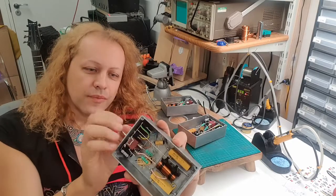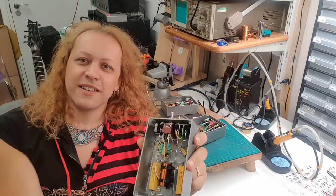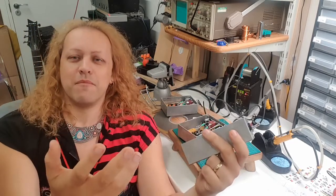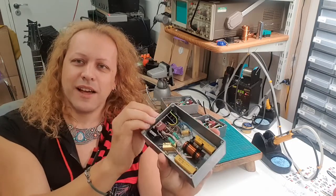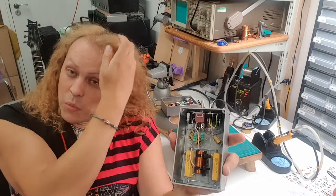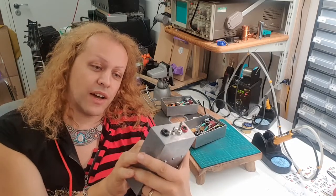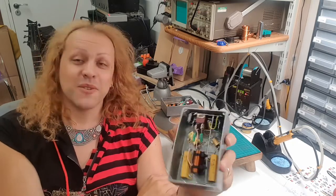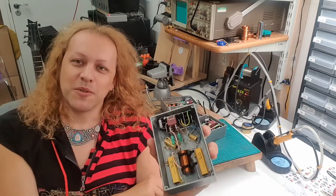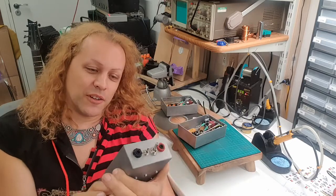That was an evolution — I decided I didn't need a mega toggle for the bypass switch, which let me fit in a smaller one. A lot of the time when designing things like this, it's about fitting parts in — your design is limited by what parts you can find. These little switches were rated at two-and-a-half amps, and since the main power has already dropped a level by that point, we're still well over ten times better than those horrible rotary switches. Heat-proof wire was a chore to find — immersion heater wire, rated to around 100°C, is cheap. That's why if you open them you'll find blue, brown, green, black, and gray wire.